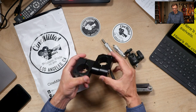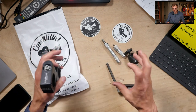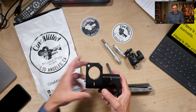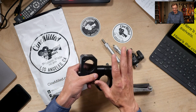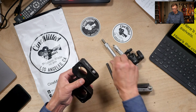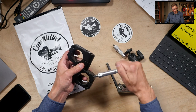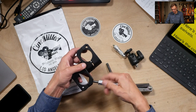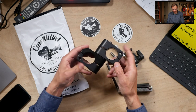And it's a little lower profile. So this is good for car rigging stuff. Just for the most part, when I'm doing a little bit of scaffolding or a little bit of rigging, it doesn't matter — I can use the other clamps. But having a few of these that have no play is really nice. And then on top of that, you have some rig points — some threaded areas where you can throw in another pin into a 3/8-16 hole at different angles. So that's pretty slick.